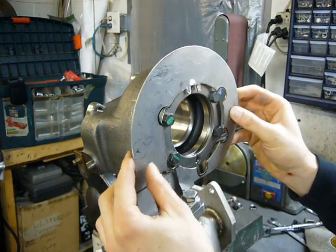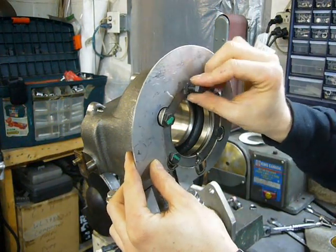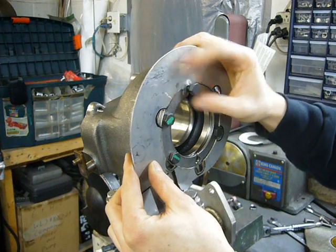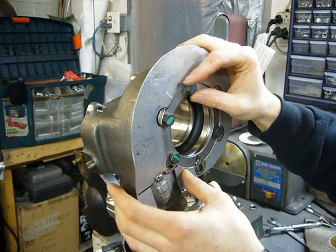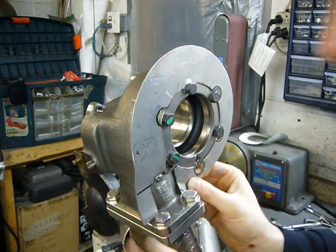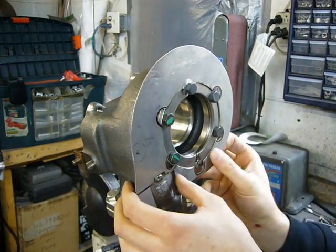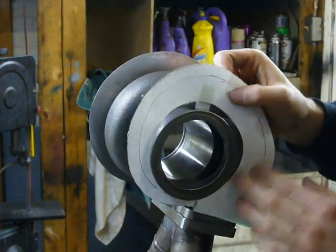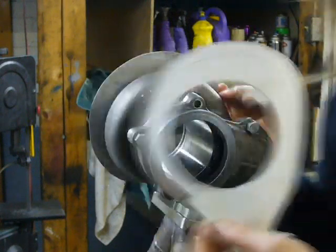This is how the first piece of the heat shield fits, and as you can see I kind of went a bit big on the bolt clearance holes, but I guess it just gives me more room to work my wrench when I put the thing back together. I also had to clearance for the bump here and I'll weld in a piece to cover that after. The rear half will be almost exactly the same as the front half, just a few minor changes, so I will do that off camera.